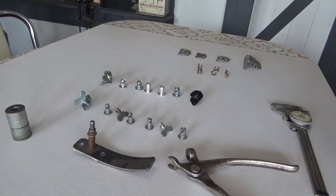The .500s I use when I'm fastening a driveshaft tunnel or a transmission tunnel into .040 pieces of aluminum. .550s will be like a thin piece of fiberglass to a piece of aluminum, or aluminum to fiberglass. And depending on the thickness of fiberglass, like some of the cars I've built, I've used like .650 long — when you're attaching a front end to a fiberglass body or something, they end up getting pretty lengthy.